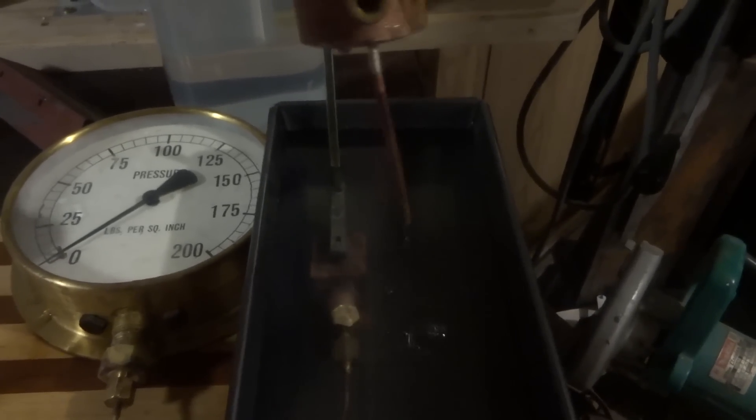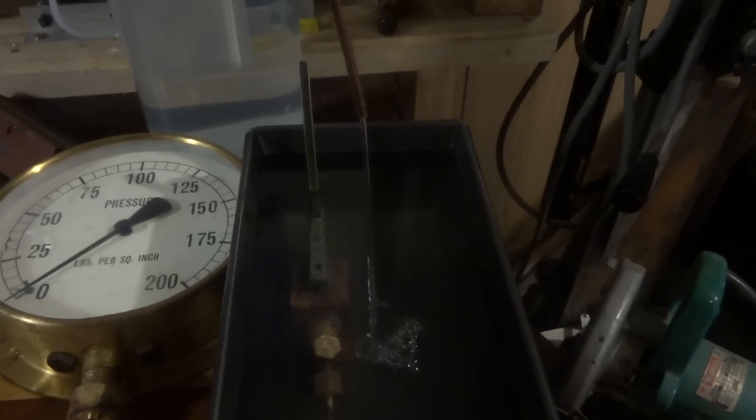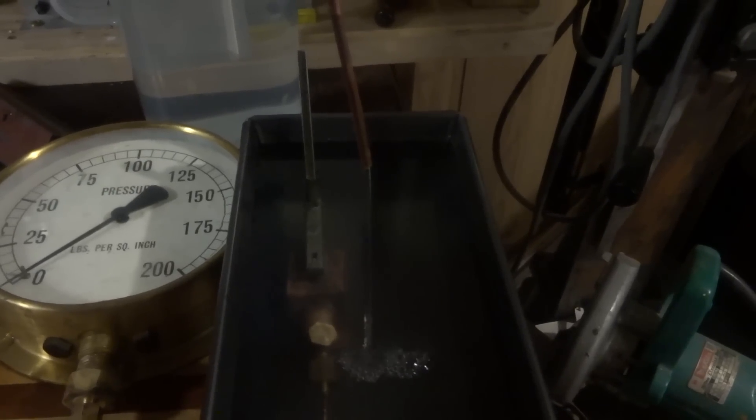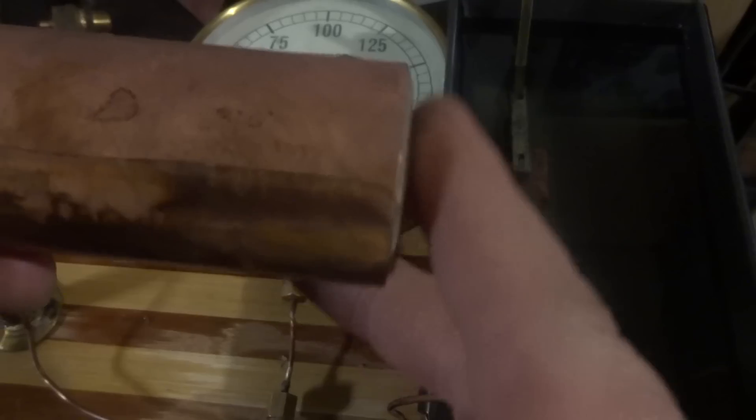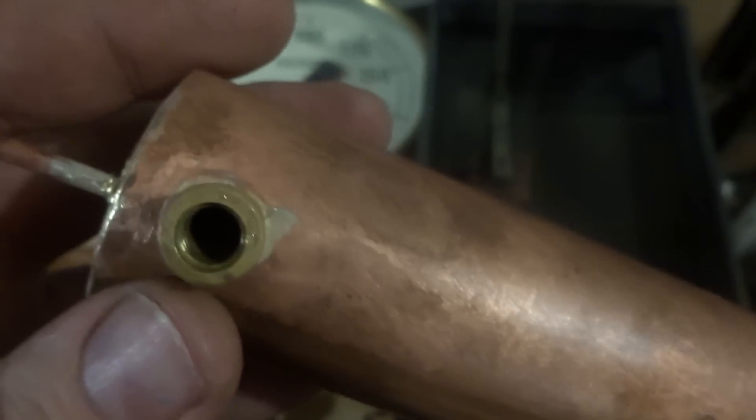I've cut the tube again and we've still got plenty of length. Drain it back into the tank. Something I've noticed — and I don't think it's going to worry us — is that we've managed to dish the ends of the boiler a little bit. It certainly hasn't let go, but at 150 psi that's probably a bit much for that boiler. Next one I make, if I make another one the same pattern, we mightn't quite test it that high. It says in the book to test it that high — I guess it's just a safety margin. At 45 or 40 psi it's going to be plenty good enough. That's the completed boiler.